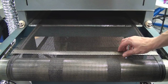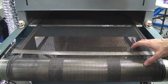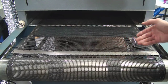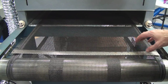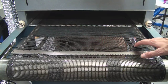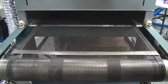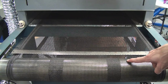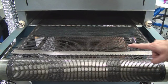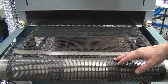I have a ruler here to help explain and exaggerate what the pulley is doing. The goal is that in order for the belt to track properly and stay in the center without moving to one side, both pulleys need to be parallel to one another. There's no real way to just set them perfectly, so you have to track them. When you first assemble and put the belt on and run it, you'll need to observe which way it moves.